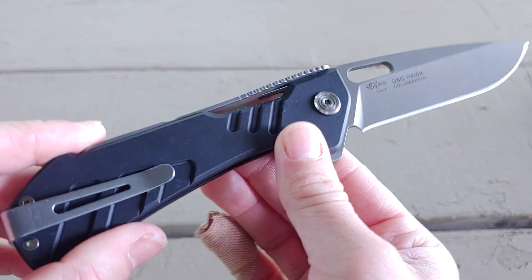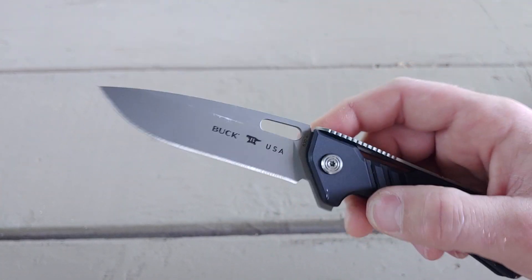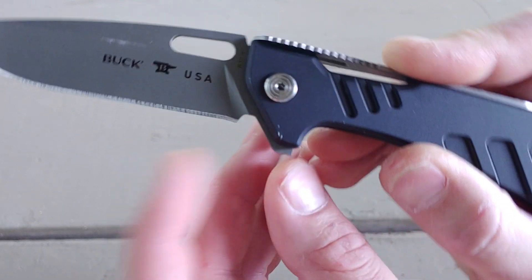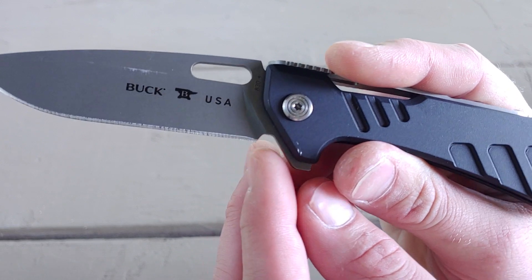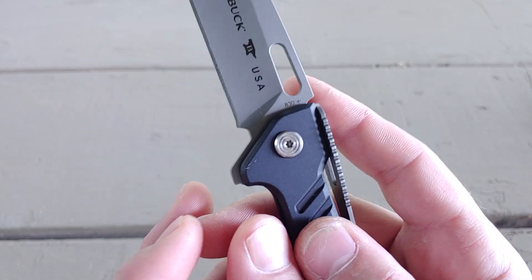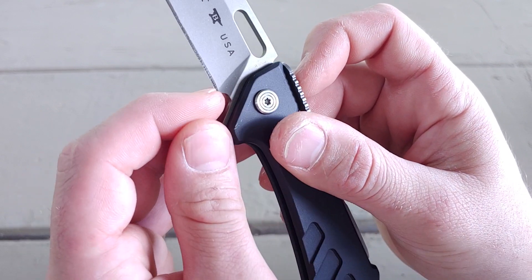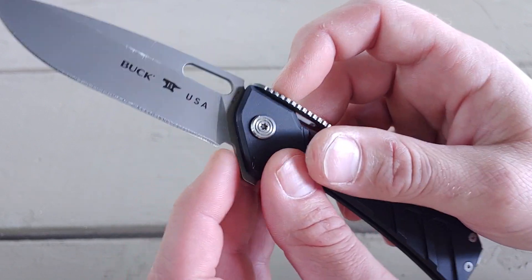Here's a need to know: all the ones I've seen that people have gotten — they did not cut the sharpening choil high enough. You see, I didn't sharpen this — I only used it — because I wanted to show you guys this. See how it goes downward instead of a smile? I've seen it on all of them. It can be fixed — just put a little diamond stone or a Dremel right there and get rid of it, then resharpen.